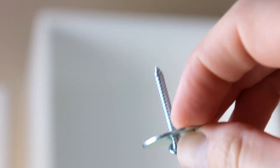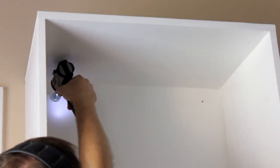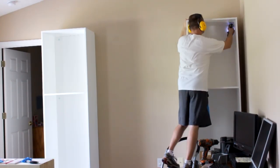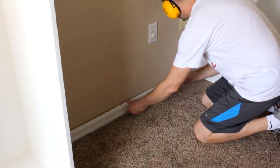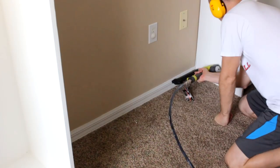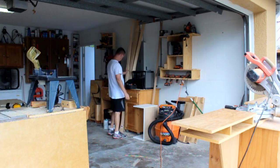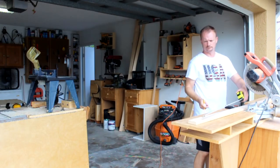I'm going to anchor these to the wall with a couple of screws and washers. If you can find some studs use those. If not, use some drywall anchors — and no, I don't care if they are plastic or metal, it's your home, do as you like. Now I can measure, cut, and tack the final baseboard piece in place between the two homeschool storage cabinets. Up the side of the cabinets you can run a line of caulk to tie everything into the wall, or take a piece of quarter round molding to complete the install. I didn't do either because I have another project coming up that will fit between these two, so I figured I'd deal with it at that point.